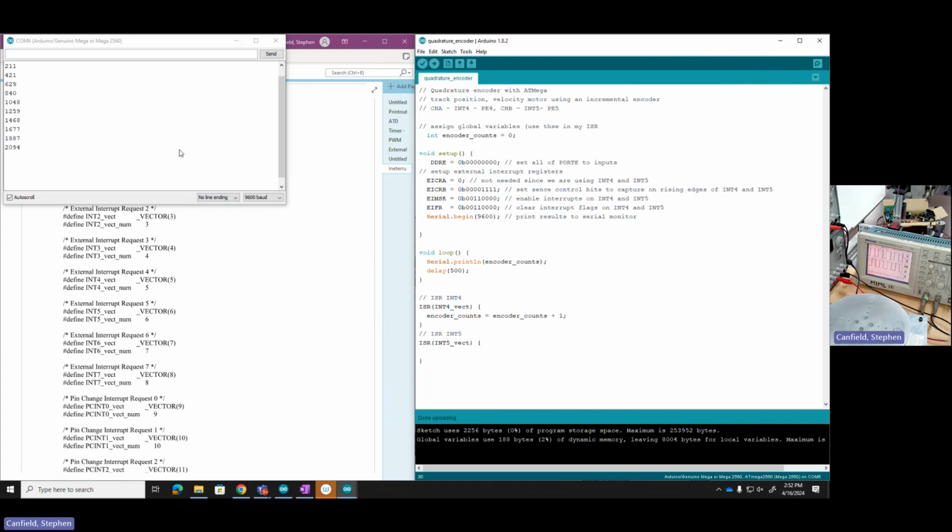Okay, so let me do one more thing. Okay. Well, it's funny because I actually said what to do, but somehow failed to do it. I didn't create the ISR5, but I was getting interrupts since I enabled it. I plugged both in. I was getting interrupts on both, and one interrupt was sending the program to memory that just wasn't mapped at all. So it's kind of really being pretty risque there with my code.